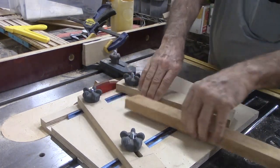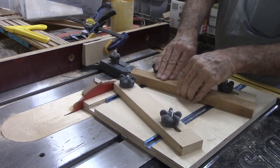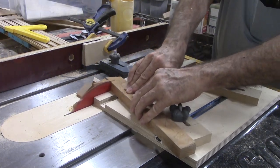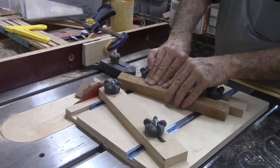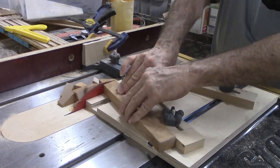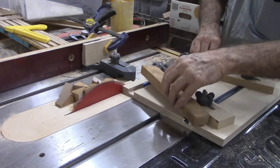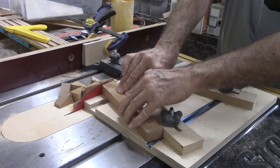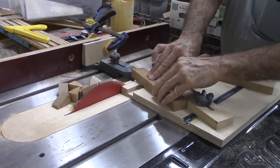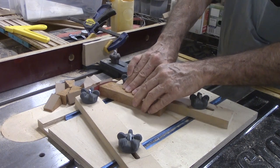I check where my fingers are before making the next cut. I have used a chop saw in the past to cut segments with a full set of jigs, however even then my fingers and hands are in very close proximity to the saw blade. I much prefer the table saw and sliding table. My blade is a sharp 80-tooth blade from a big box store — it cuts smoothly enough that I do not need to sand. Others of my associates also use a clamp to help hold the wood, but with the overall process I am demonstrating, I do not need to take the extra time to engage and disengage a clamp for each segment. Since this is for a 12-segment ring, I cut all 12 and only 12 before moving to glue them together.